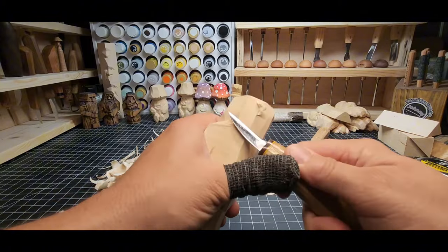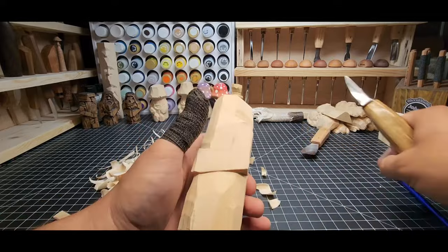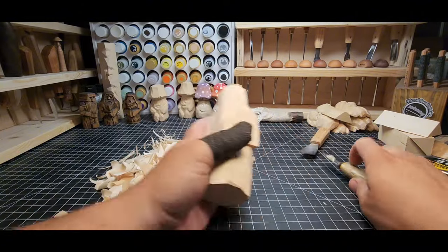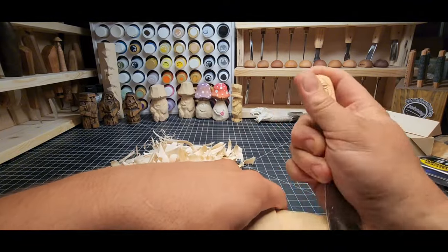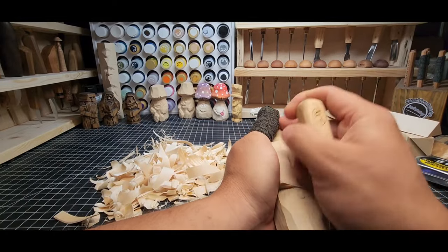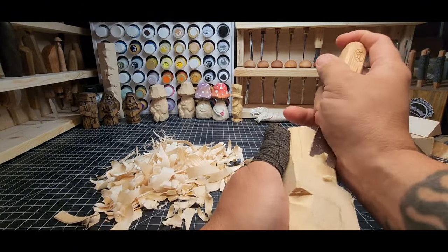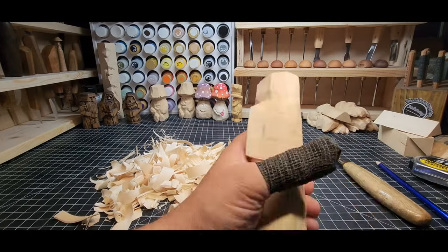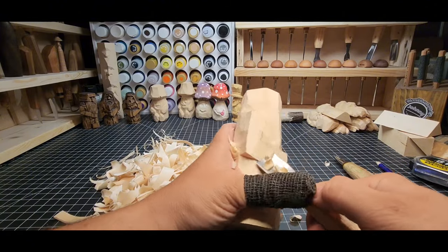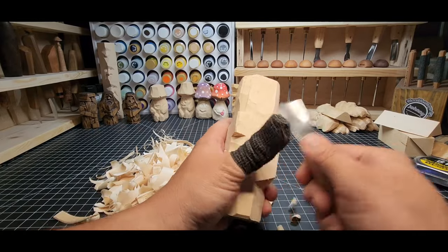You want to get that face pulled back a little bit, so taking these rough areas and saw marks off as well while we're here. I started taking off the bottom there but that was the wrong grain direction — that was going to cut real deep, so we don't want to do that. We'll take these saw marks off down here with the KCT number three gouge so we don't have to worry about that. We're not going to go too much deeper here so we want the saw marks gone. Get the saw marks off the left and right arms and shoulders now so they're just gone and out of our way.